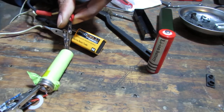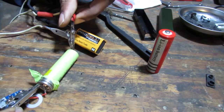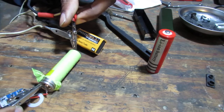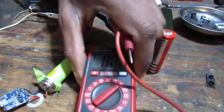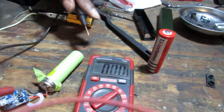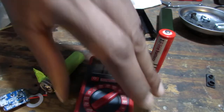Now here's the problem, right? It's called a burn test. Batteries should charge slowly if they're healthy. To charge quickly, they're not healthy, you know? And we know this is a 3.5 volt battery. So for it to gain so many volts in like 15 seconds tells you that it's most likely shot. See, 2.9. Yeah, I can't trust this battery. Either way, it's worth playing around with.